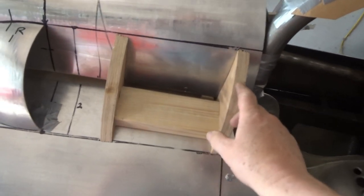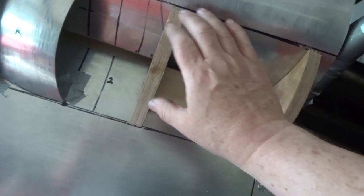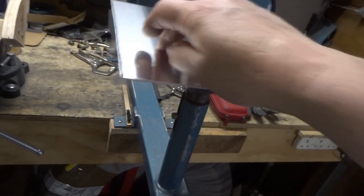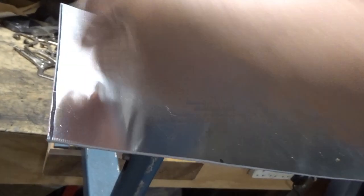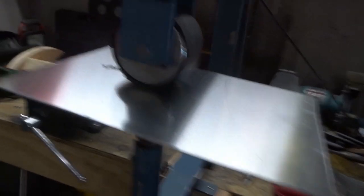I've made these two bucks — it's not so much about the angle here as the curve. So that bit pulls from the fairing and then it'll be straight and then slowly curve in. I've got my panel cut — this needs to curve, that needs to taper, or alternatively this needs to bulge out — and there's my buck. I'll see how it goes: start with the rubber wheel, put some curve on that way, then bow out the middle. I might even try using my shrinking hammer — you can put creases in here and then hammer them out, and that actually shrinks the metal a bit. I might get away without using that yet, but maybe it's a skill I should learn after I spend enough time building the shrinking stump.